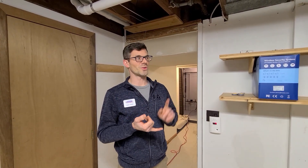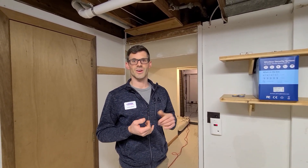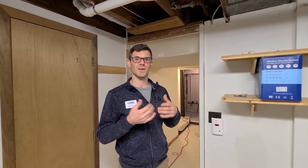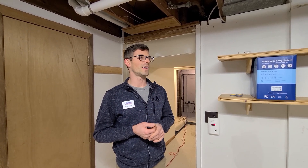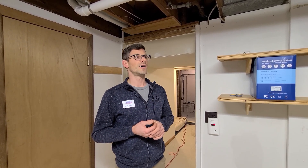To wrap up, I'm going to do my backdraft test on the natural draft water heater to make sure they don't have carbon monoxide issues, clean up, and do my Department of Health paperwork. They've got the electrician coming next week to add an outlet and a light in the attic. Also want to make sure they label the breaker that the radon system is on. If you enjoyed this video please like and subscribe — I'm Jesse with American Radon, thanks for watching.